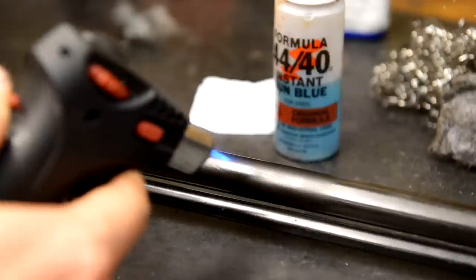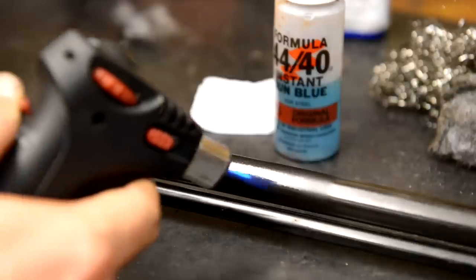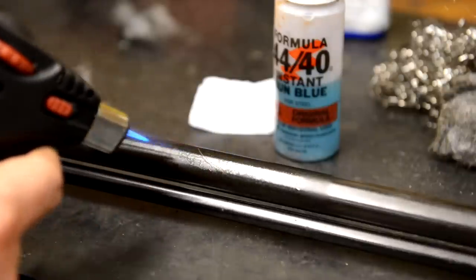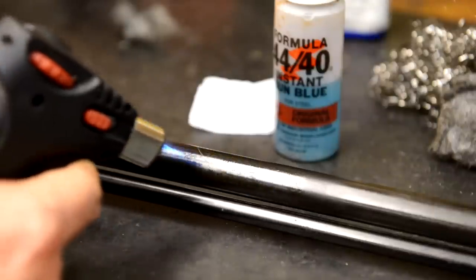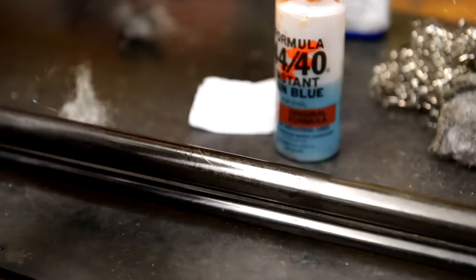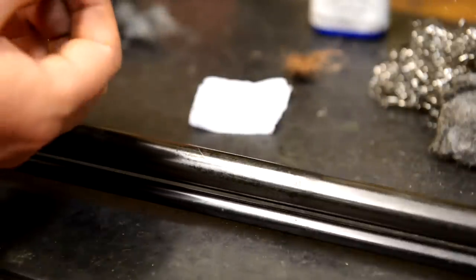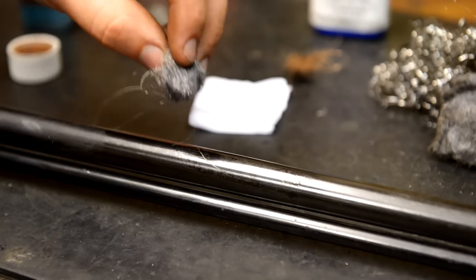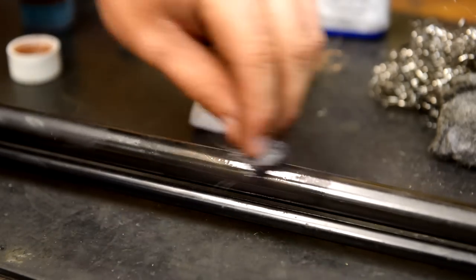Same thing on this area of the barrel — we're going to go ahead and warm it up a little bit. And this time we're going to use 4440, which is one of me and Ray's personal favorites. It helps to degrease, but the nice thing about the 4440 is it cuts pretty well. You really don't have to worry about it that much. This is just the way I do it and I don't generally ever have any problems. 4440 this time — this is an excellent product, highly recommended. I'm not knocking Birchwood Casey. You can already see even the bluing on the steel wool, it is much, much darker. We're going to take our Q-tip and just give her a little shimmy there, and that warmed up nice.